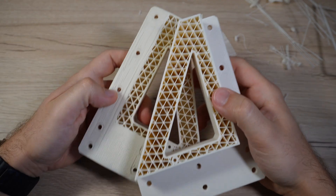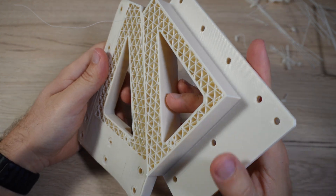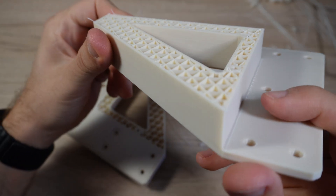Before we go to the design phase, let me share a few considerations relevant for your project as well. The parts should be easy to print - ideally with ABS or ASA. For me it didn't quite turn out as expected and I moved back to PLA; I'll share why during the lessons learned. The tolerances should be very tight, so if you have the bracket going on the wall mount or on the 20mm extrusion profile, you want it very close so the parts will not flex and bend when you tighten them to either the extrusion profile or the wall.